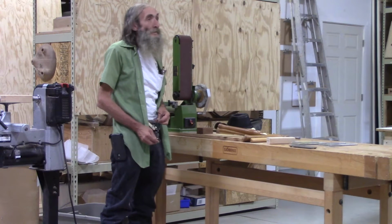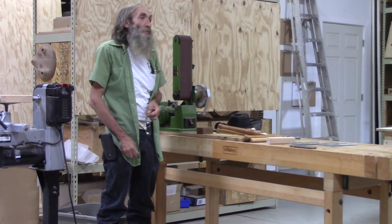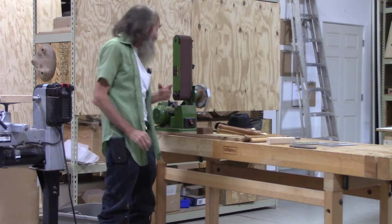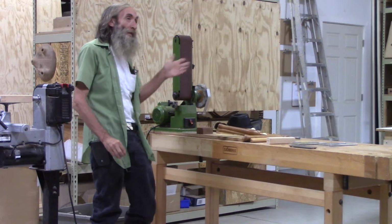So by simply turning the fan belt into a figure 8, it reverses the direction. And the only reason I went for a 1 inch longer belt is that there isn't enough play in this motor to move it forward and back enough.